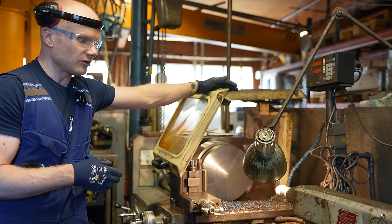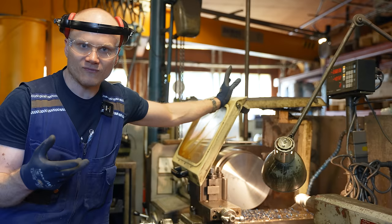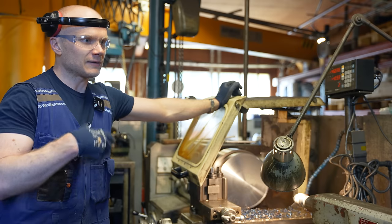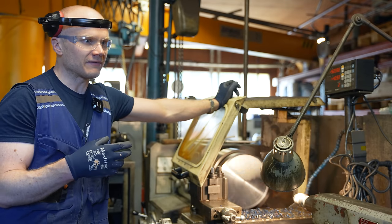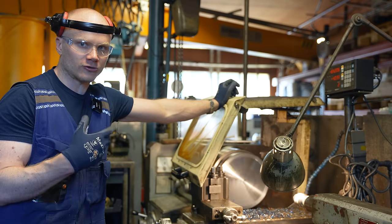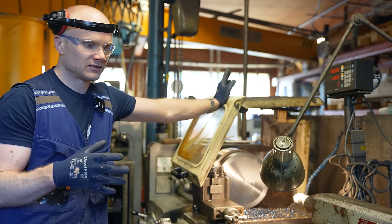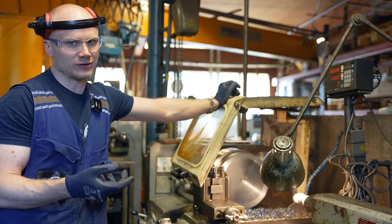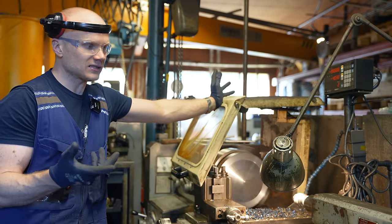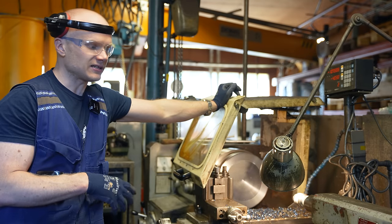I also realized that there's a second aspect to really knowing the art of machining. I think you have to know what the part is for that you are making, or read the picture and check the tolerances. Because some people get slowed down by doing things too well. If there is a really loose tolerance, it's not going to be any better part if you make it to a really fine tolerance. So you have to know what matters and what doesn't matter, and then spend your time on things that matter. That's also one thing that makes you much faster.